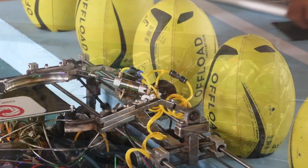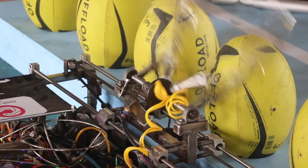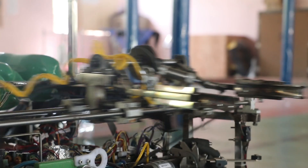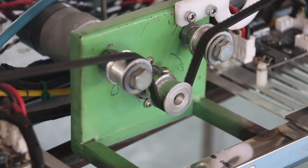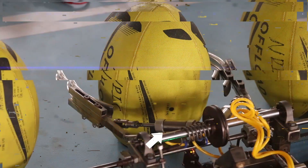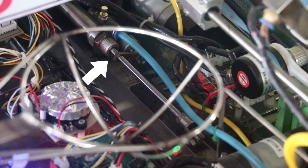The robots of Team Cambodia B have many unique features. The passing robot has a gripper that can slide left and right automatically using a DC motor with a rotary encoder. Two small cylinders are used for gripping the ball, and another cylinder moves the ball into the center point of a pneumatic throwing arm.